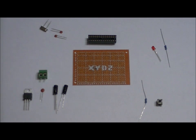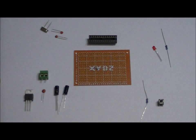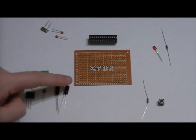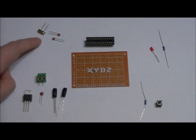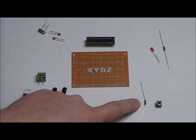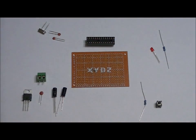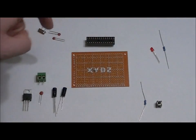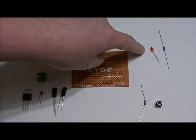Based on that video, what we've got here is our basic power supply circuit comprised of a 2-pin terminal block, a 5-volt 7805 regulator, a 0.1-microfarad ceramic capacitor, a 10-microfarad electrolytic capacitor, and a 100-microfarad electrolytic capacitor. We've got our crystal oscillator circuit with one 16-megahertz crystal oscillator and two 18-picofarad ceramic capacitors. We've got our 28-pin DIP socket for our ATmega 328PU chip, a reset circuit with a 10-kilohm resistor and a momentary push button, and a 470-ohm current limiting resistor for our 3-millimeter red LED.